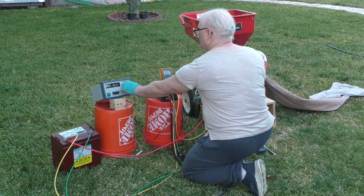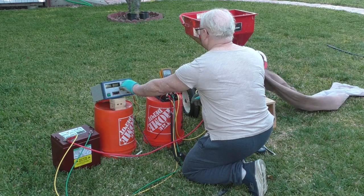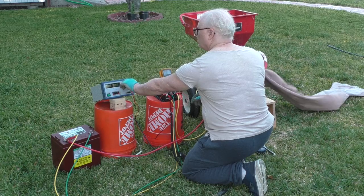Now I need to run it back up again to see how many amps are flowing through the system. It is running at about 60 amps, which was higher than expected but within the parameters of the battery. I am estimating run time at about 30 minutes.